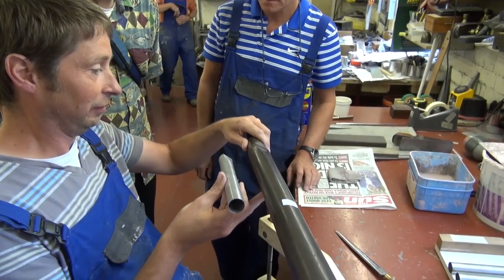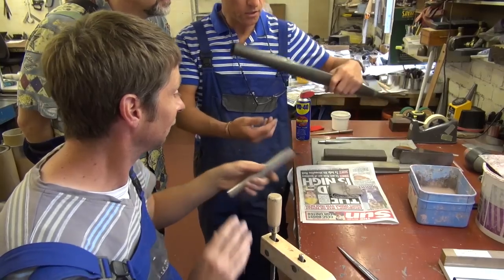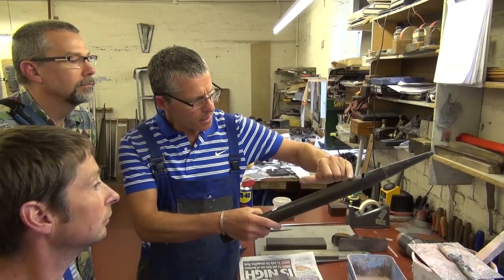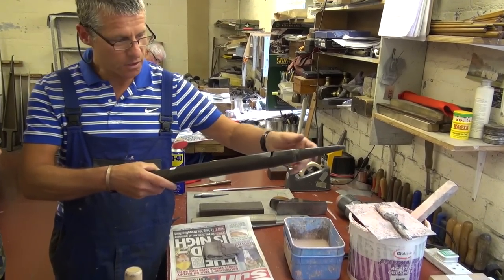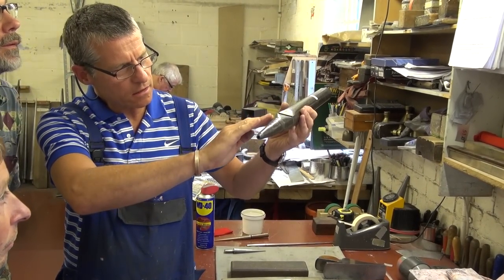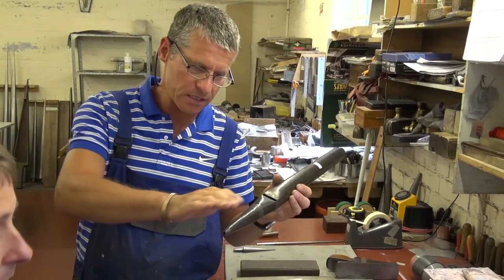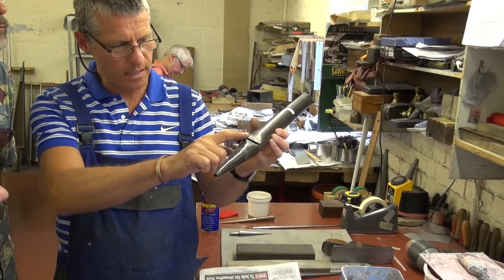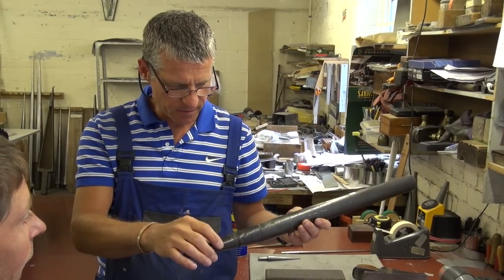You've got to check the flattening is the same. This is how we actually test the flattening as well — if you hold it in the light, you'll see where that shines down. There's a slight scoop on the lower lip; there's a curve, it's not flat. And that curve — you can see on the side elevation — there's a gentle curve, and that's the best for voicing, because the wind glides into the upper lip. If that was dead flat, we don't like that ourselves. The scoop section, which is more German, doesn't really appeal to the British market.